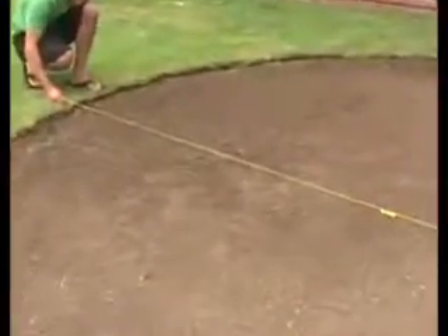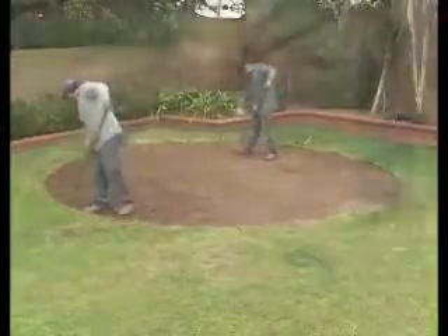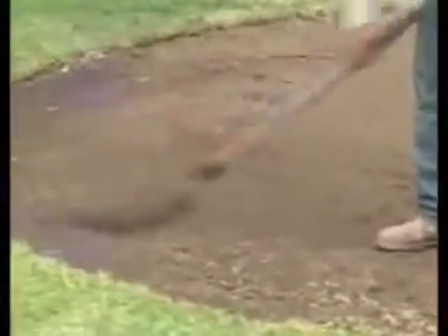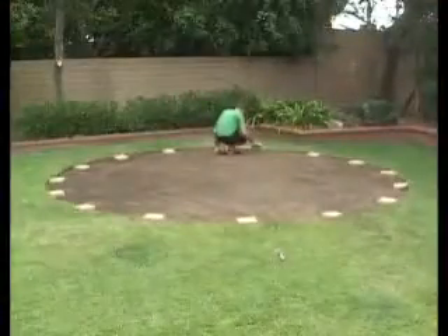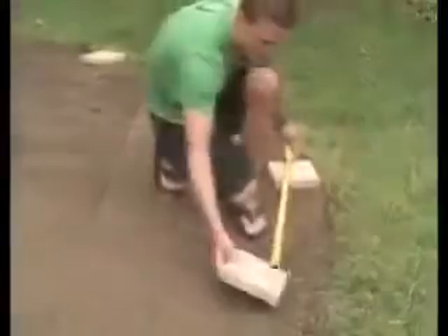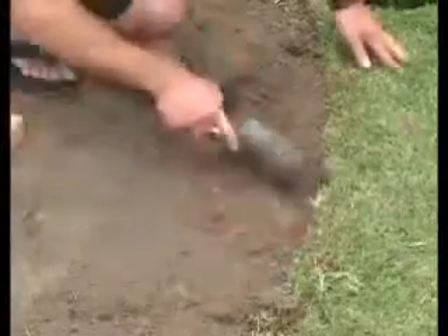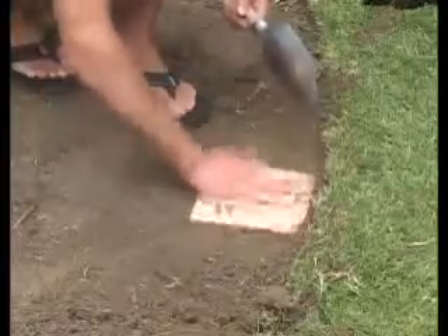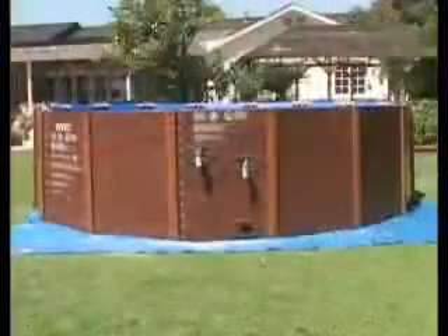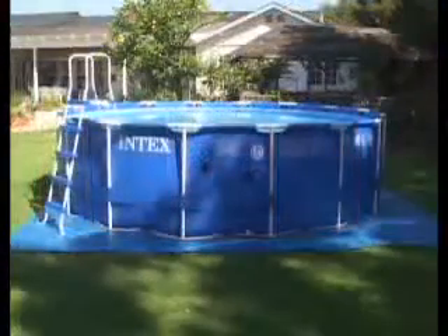Level and check to make sure there are no high or low spots anywhere within the circle. Tamp the pool area to firm up the soil, paying particular attention to the outer portions where the metal posts and enclosure supports will be located. Embed 16 46-centimeter by 46-centimeter concrete pavers flush with the earth, situated every meter directly under both the metal post feet and each of the bottom joints as shown in this video, or pour 5-centimeter thick concrete pads. You may wish to hire a contractor to help with this portion of your setup. This will keep the enclosure level with the pool when the pool is full.